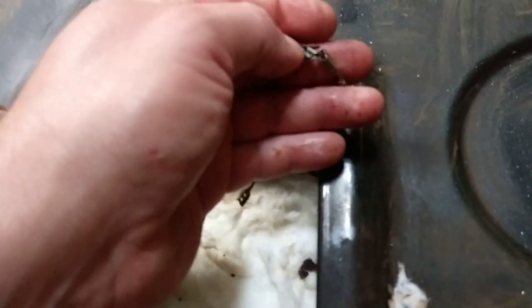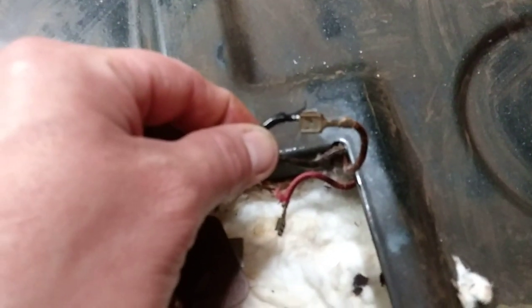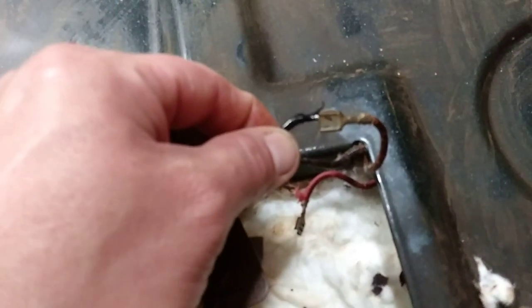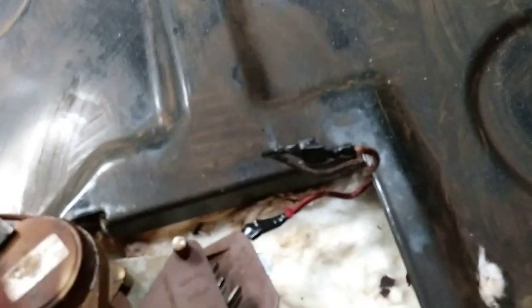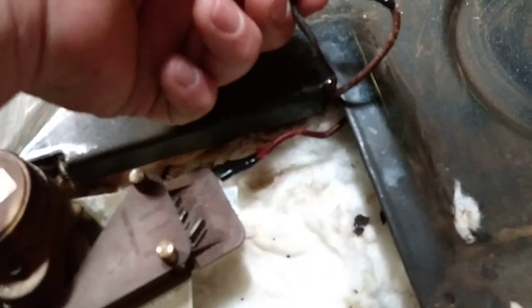You want to get some electrical tape and tape that around — tape it up. Just slide them in together like so. Put these two together right here, then tape them. I got these taped together. As you see, these terminals are just fitted together, slid into one another, and taped up. So it's not grounding out onto the metal.